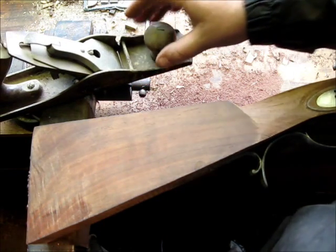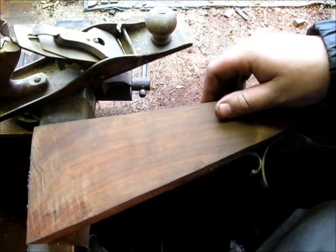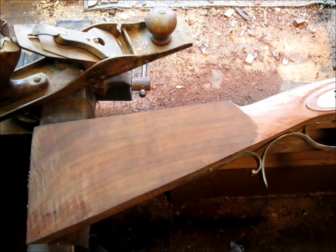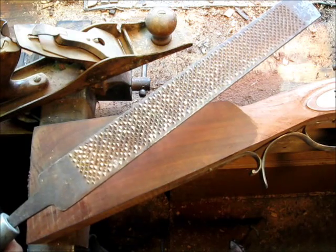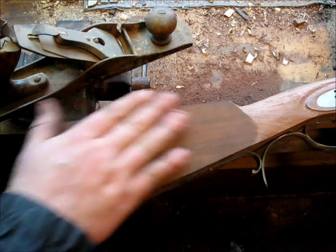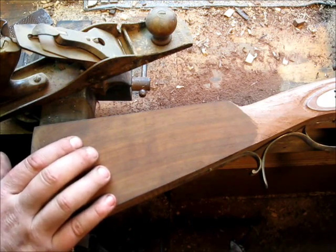The way I like to start, to get rid of the really bulky parts at the corners, is I like to use planes. A lot of my planes are fairly old — I inherited them from my grandfather and my father. They're old and a little used and abused looking, but they're still flat and true and they still cut really nice. If you do get into some really heavily figured wood where it's got some gnarly grain patterns, sometimes a plane doesn't want to cut across those very well, and so a farrier's rasp will take it down almost as quick as a plane. Usually I use planes to remove the bulk of it and then start in with files. If it's cutting really bad, I'll start with a farrier's rasp and work it from there.